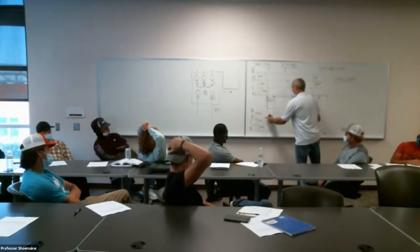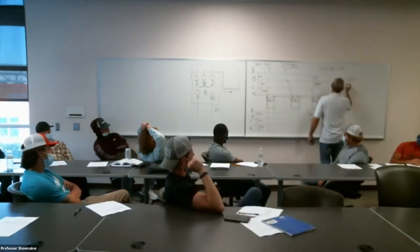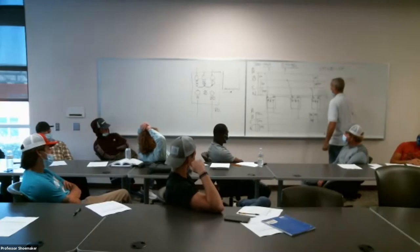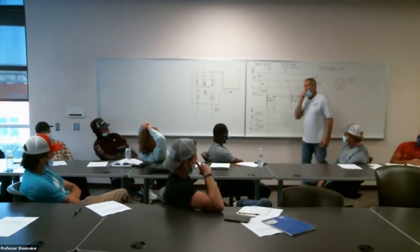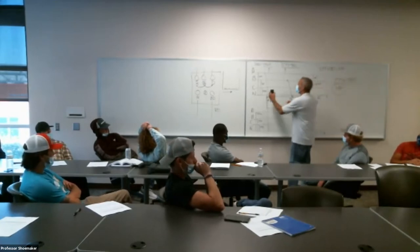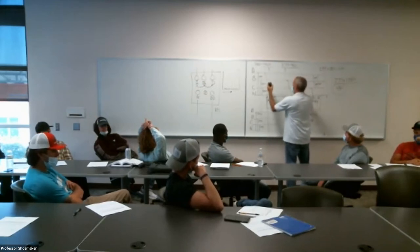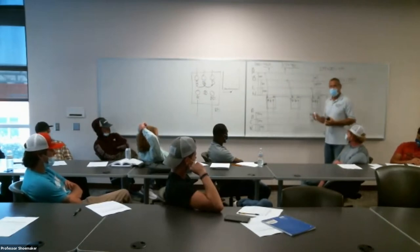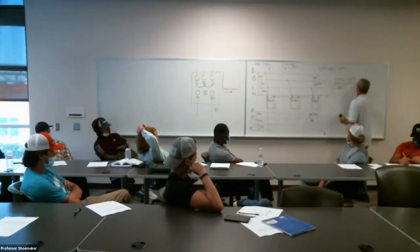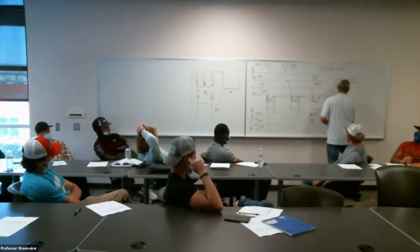If I took 277 and put 277 together, A to B, it's the same thing. 277 times 1.732 equals 480. Okay? Remember that magic number. Whenever you start using two or more transformers, and you need to do the phase to ground of both transformers combined, you've got to use that number. Why? Ooh, that's the big question. Why?